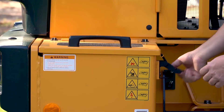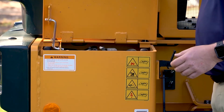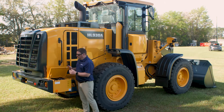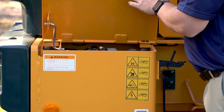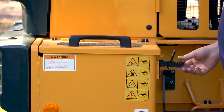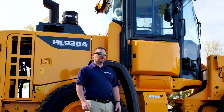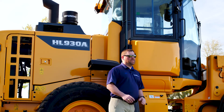In front of the rear counterweight on each side are our battery compartments. The unit has a 24-volt system. To open the battery compartments, you simply open this T-lock handle and open the battery door — the lock bar will fall into place. To close the battery compartment, you simply push back on the lock bar, let the door shut, and then replace the T-lock.